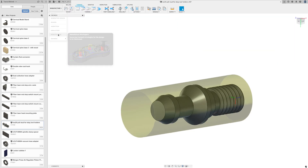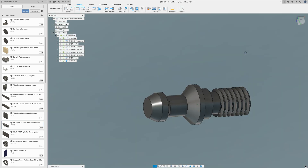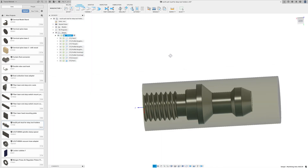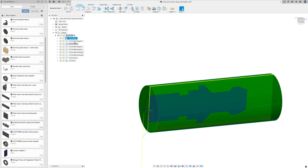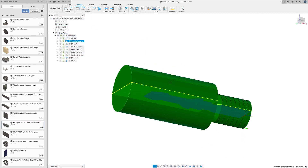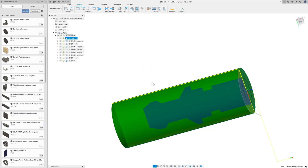This was my first time trying to set up a CAM operation for a lathe. It took me about 12 tries before I finally got it dialed in how I wanted it. But for my first time doing it in Fusion 360, it was fairly easy — just putting in the size of my stock, doing a facing operation, and then a roughing profile before I did the threading.